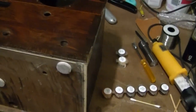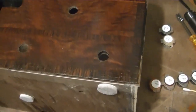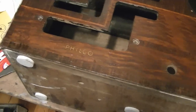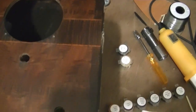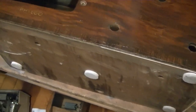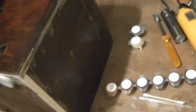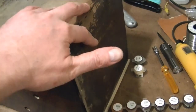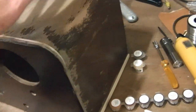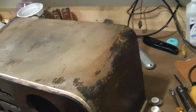I spent about an hour touching up the front and I think it looks a whole lot better — not perfect, but I think I've spent as much time on this as I care to. I'll let this sit overnight and dry up as the instructions recommend. Then I'll clear coat the front with a coat of sanding sealer, and then move on to the rest of the cabinet, which will involve sanding down this trim a bit, stripping the rest of the cabinet, painting this black, and then start sealing and grain filling, and finally toner lacquer on the body of the cabinet.